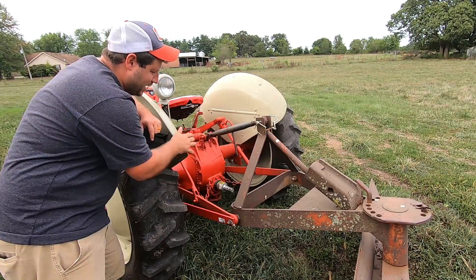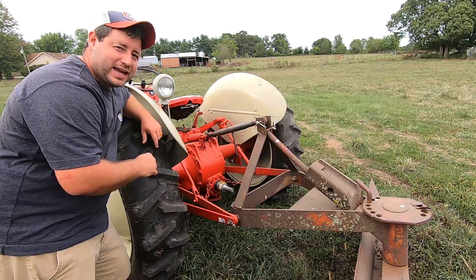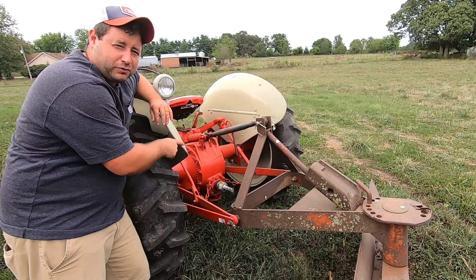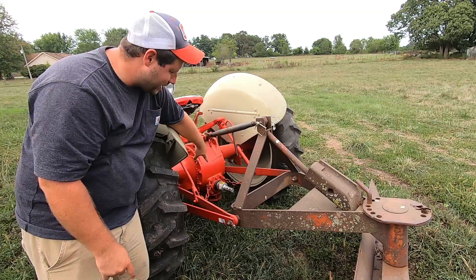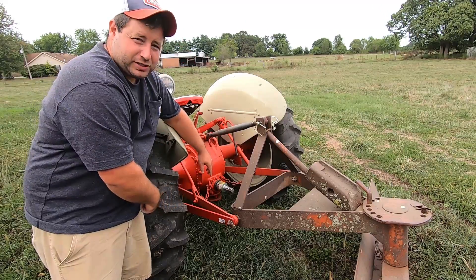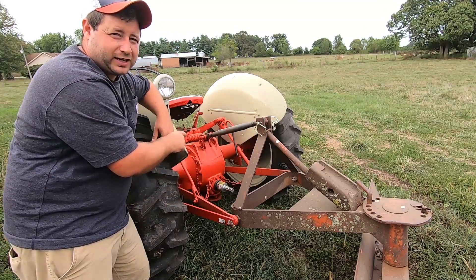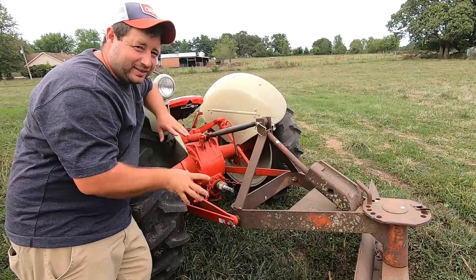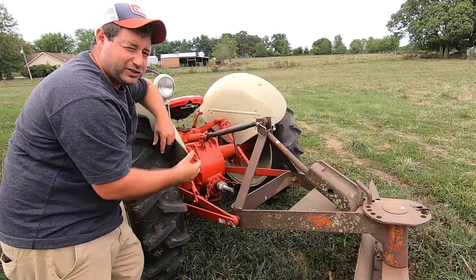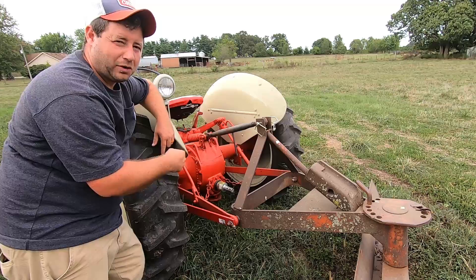Coming to the back of the old 8N, like I mentioned, we do not have live hydraulics or live power. What that means is that we have to have the clutch engaged and the PTO turning in order to lift anything. Secondly, you have to run the overrun coupler — that's the silver and yellow piece on the back — because if you don't, a brush hog has so much momentum it will directly push the tires. You'll go through a fence, you'll go into a pond, and it's no good. So you have to run an overrun coupler. And lastly, we have stabilizer bars to keep everything stationary — I just run one, keep everything centered — but it's one more thing that we have to put on.